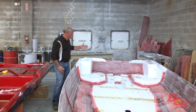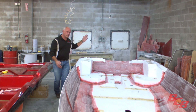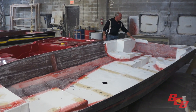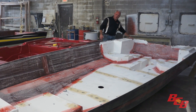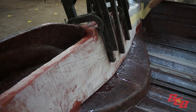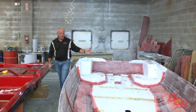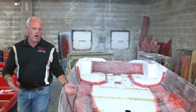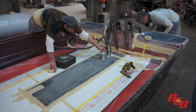Another thing you can notice right here is the width of the transom. The transom's full width — it runs from this point to that point, all the way across and depth-wise. So that full transom, that 65-pound transom that we looked at out there, it stretches through this whole bottom and all the way across in full depth. It's a nice setup. This is a one-piece construction hull, all vacuumed together with our vacuum process.